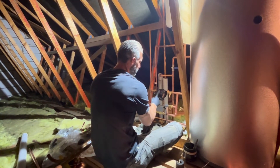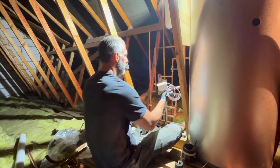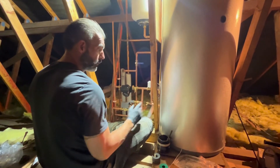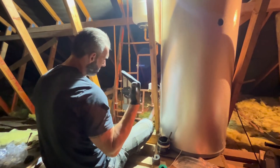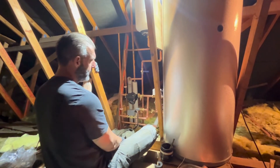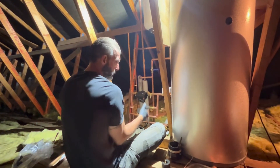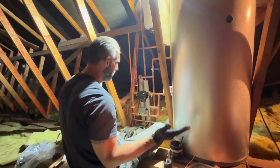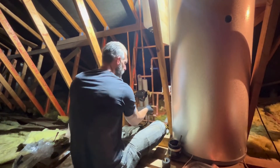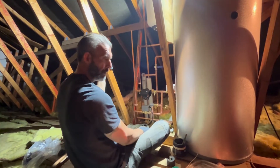So: primary flow, pick up on the pump, put in a motorized valve for your hot water going to your cylinder. That will open up and give your hot water to 55 degrees — I'll wire in a cylinder thermostat set at 55 degrees. As soon as it reaches 55 degrees, the boiler will shut down and that valve will close. Turn the room thermostat up and it will circulate around the heating. We're also adding an automatic bypass — when both valves close after reaching temperature, the pump stays on for five minutes, so the bypass protects the boiler and pump from overheating.